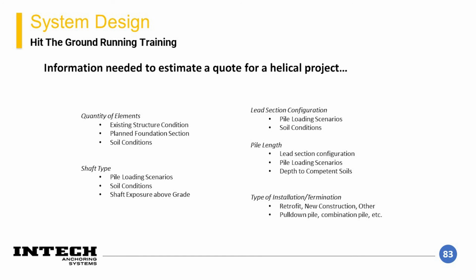In order to accurately estimate a pile that will work, there are a few major things that we need to know about. First, a major piece of information that helps us create a more accurate representation of how the soils will react to the load is a geotechnical report with strength information. Typically, these reports are performed by a geotechnical consultant and include drilling, blow counts, and lab testing.